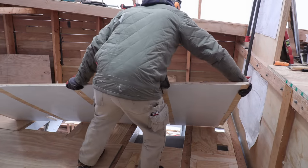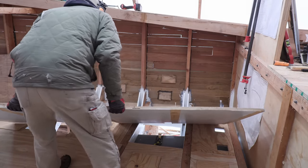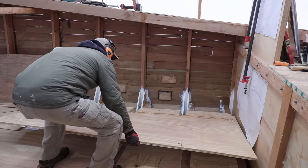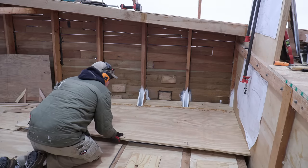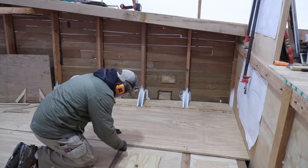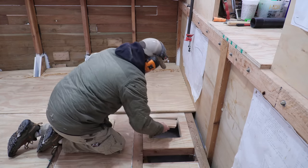I didn't worry about cutting bevels for the smallest hatches because those will be covered by cabinetry and won't be walked on anyway. But with the rest of the beveled subhatches fit into position, I could return the top layer of the sole into position so that I could make my marks to cut the top layer that would fit over the beveled panels.